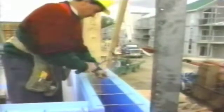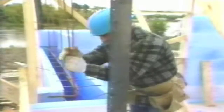Assembling the polystyrene prefabricated sections is surprisingly easy. Let's look at it closely. A polymer T is cast from the same mold as the polystyrene prefabricated section; it acts as a guide when the sections are being assembled. The T is also used as a surface upon which to screw furring. Holes placed in the T allow for the insertion of the tie rods. These rods, measuring 6, 8, 10, or more inches in length according to specifications, are used to assemble the prefabricated sections parallel to each other. The notches on the assembly rods serve to position the rebar in the required position.